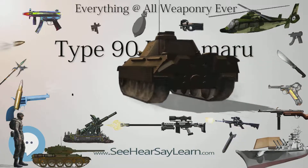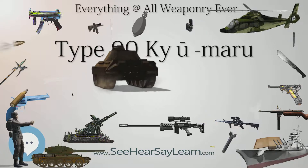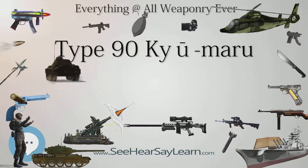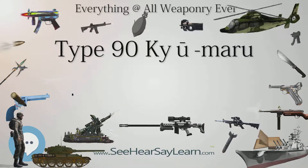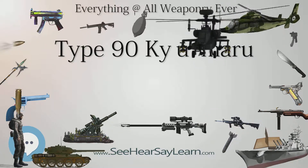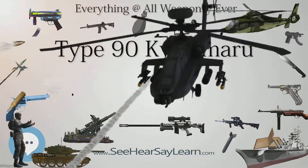The system is capable of tracking soldiers, vehicles, and helicopters. The targeting computer can also calculate lead on moving targets. The commander's sight consists of a 3x–10x day-only sight that can track vertically from -29 to +29 degrees, as well as horizontally through 180 degrees. The gunner's sight has a 10x zoom.